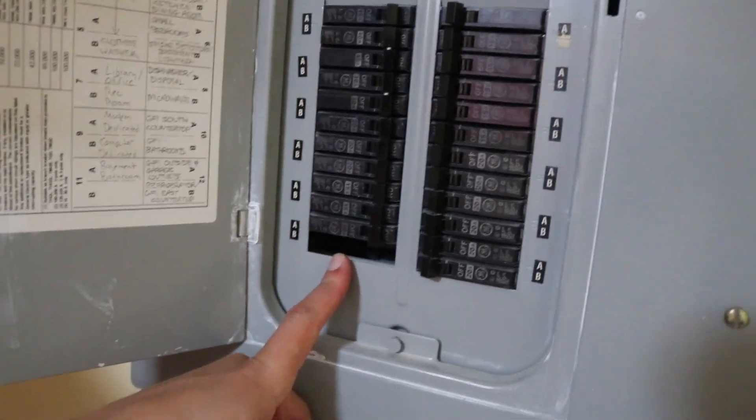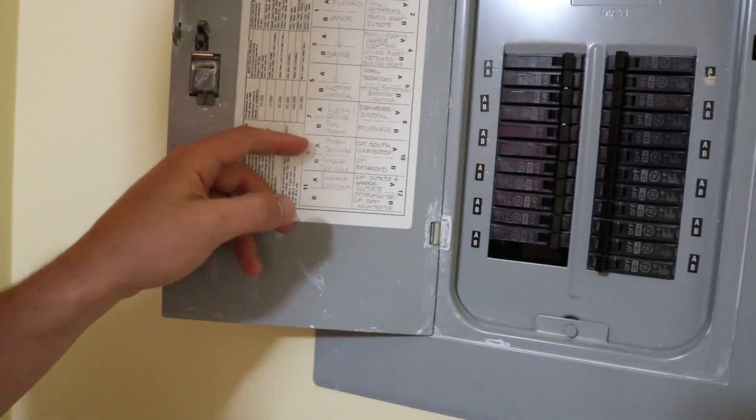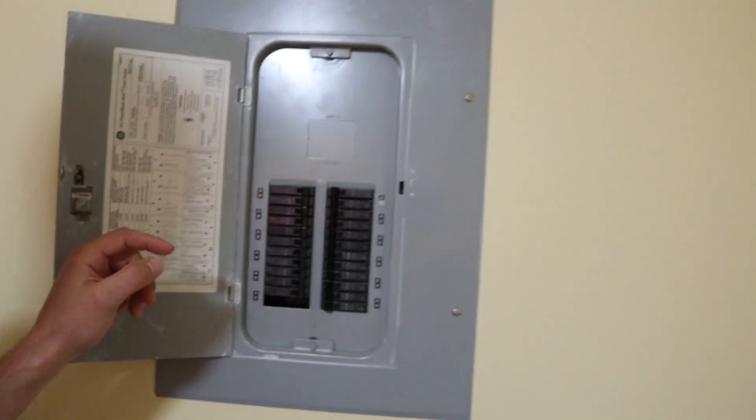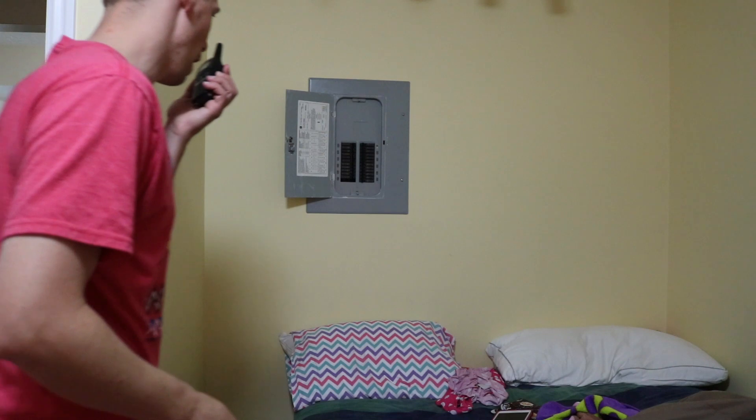Today I am going to try and get some wiring and circuit breakers mapped out in my house, because I'm looking to remove one of my circuit breakers from my panel so that I have room to add a double pole, double throw. Right here is my box, and as you can see I've got one spot at the bottom that's open still — the rest are full. What's got me curious is I've got some that say weird stuff like 'dedicated modem' and 'dedicated computer,' and some of that I don't think is being used. I've got my daughter upstairs in one of our bedrooms with a bunch of nightlights. The idea is I'm going to start switching off breakers, and when we figure out which one controls that room we'll mark it down. I've got a little map drawn up. We can mark down exactly what breaker goes to what room and see which ones we can eliminate — hopefully at least one, I think there might be three. We've got walkie talkies so she can tell me when the lights go out. Alright, I'm going to start shutting off breakers.